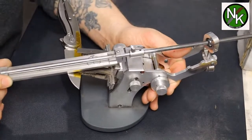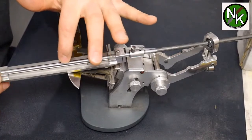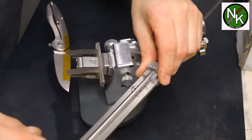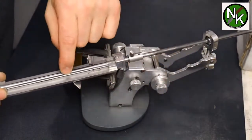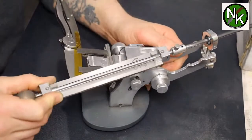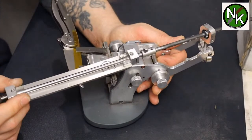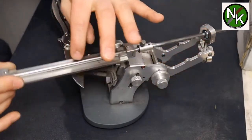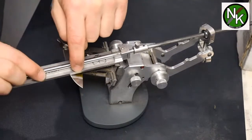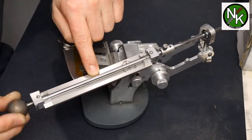In fact, what I like to do is I don't even go past the beginning of the stone. So picture the rod is the middle of the stone, right? I don't let the tip go past the rod. Now, if I ever do, it's because I'm very calculated with what I'm doing. I'm literally focused on my pressure, how I'm applying pressure to this side of the stone, not this side, because if I apply it to this side, it'll fall off for sure. But if I'm holding pressure to this side, I can prevent it from falling off.